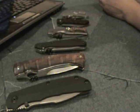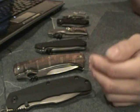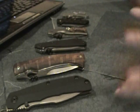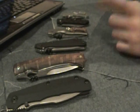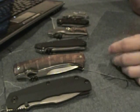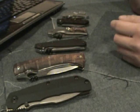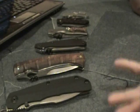At the top of the list you have the high alloy steels — ZDP-189 is much more brittle because it has like 23% alloy. With M4, you took out the chromium, which was adding alloy that only helps with the stainless aspect. Remove that, and now you have a tougher steel blade.